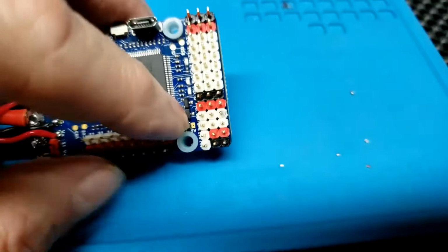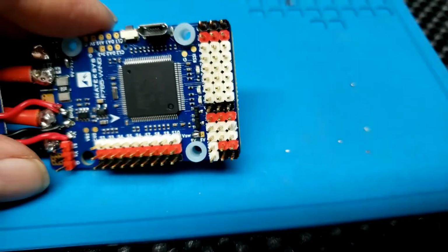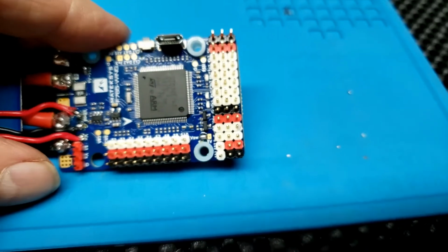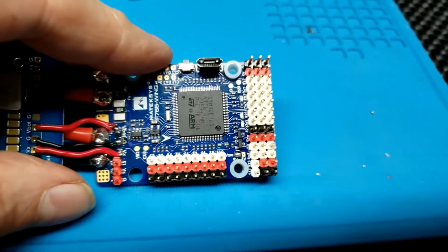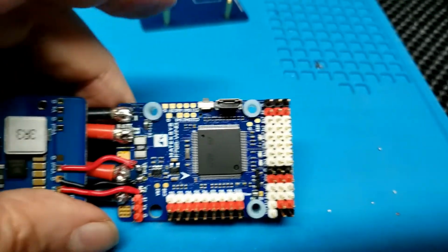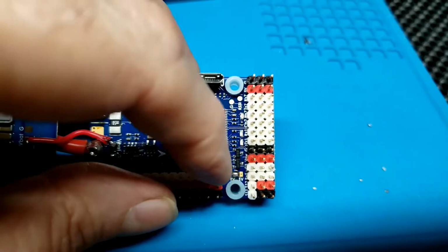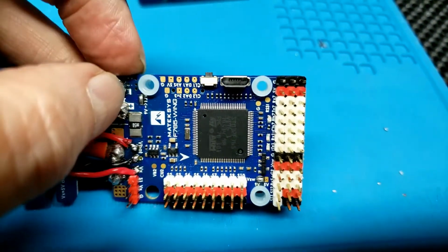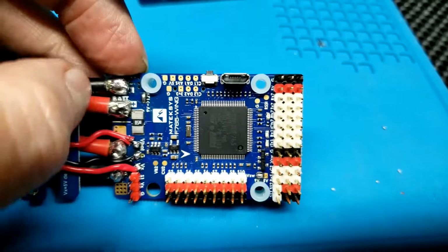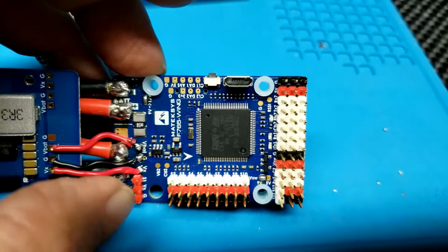And just for kicks and grins, I went ahead and put 2 white pins right there on servo 11 and 12. I think, yeah, I put a pin in every hole. Bridged the solder pad there I needed for 5 pull up to 9 volts, and over here for 9 pull to 12. Those 3 wires in there are just a pain in the posterior.